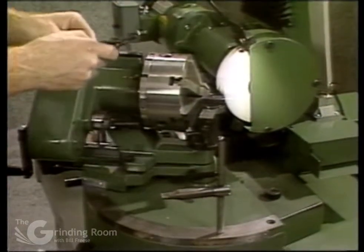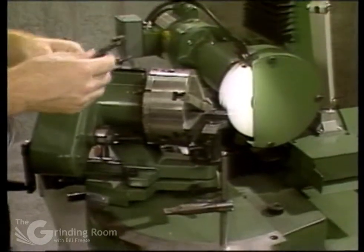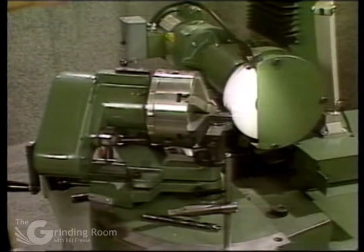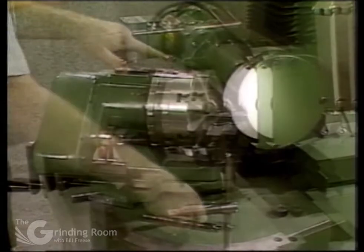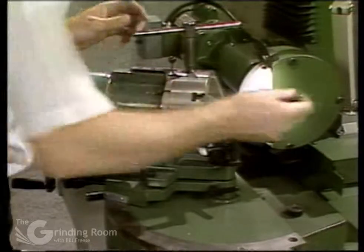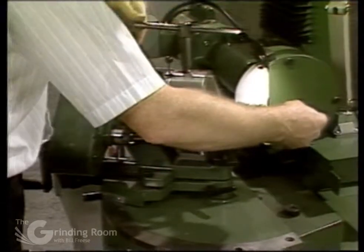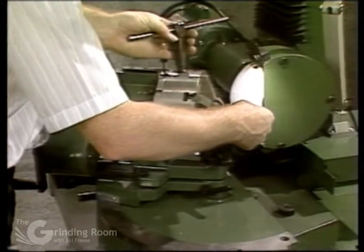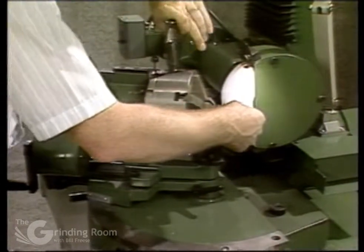The angle that you want to set up to grind — without oscillation, you should set the zero mark to the included angle that you want to grind. Put it in the right-hand slot. Just set the lip of the drill out in a convenient spot.